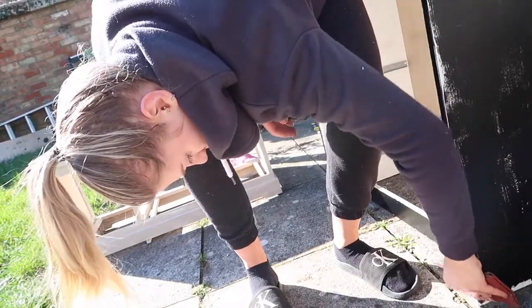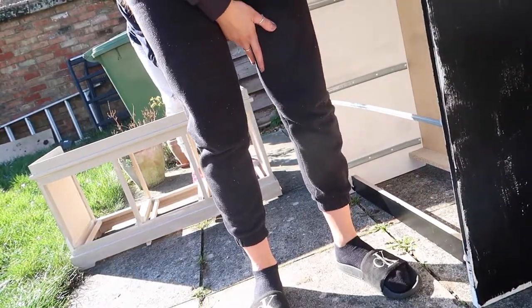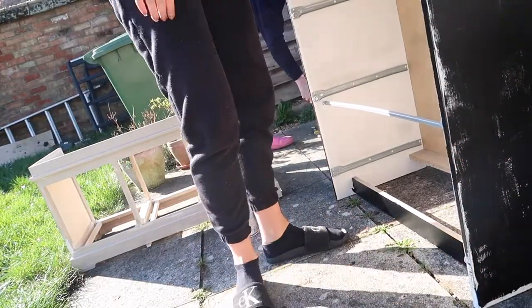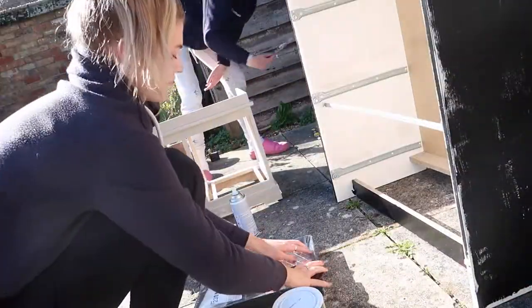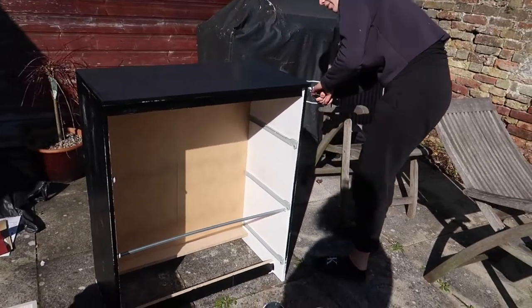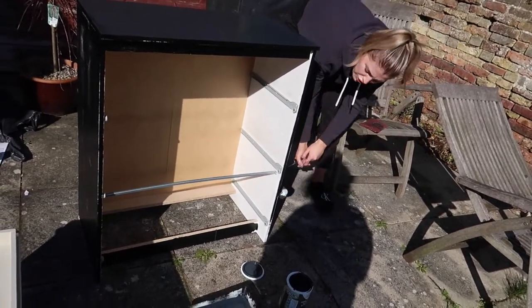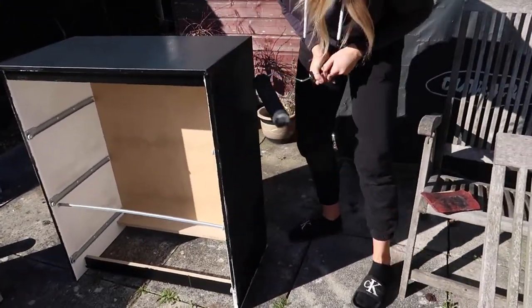I nipped back to B&Q and picked up some sandpaper to sand the drawers down, just to give the surface a bit of grip so the paint would actually stick. In the end I used the Valspar wood and metal paint in the shade La Planca, code W35D - it came out such a beautiful colour, exactly what I was looking for. No regrets on messing up because you can learn from it. The frame took a couple of coats - I used a smaller brush for the little bits at the bottom and a roller for the base, which gave it a really smooth finish.